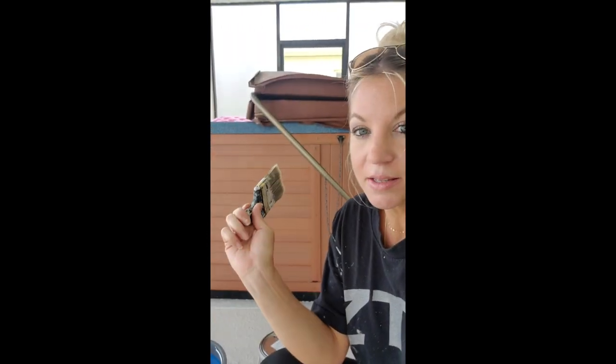I'm not going to use a primer on this one — I don't think it needs it. This PPG exterior paint has the primer already built in. It is a resin material, not wood, kind of like a plastic. I'm going to apply it with my trusty two-inch angle paintbrush — I use this for everything. I'm also going to use a small roller and use the paintbrush for cutting and the cracks in between the surfaces, then roll the rest to get a smooth and seamless finish.